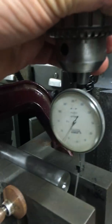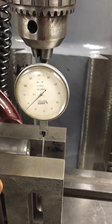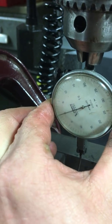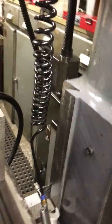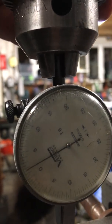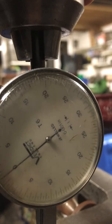So from naught to there I've got to move it about eleven thou. I come back to the side I can see easiest and wind the actual handle of the machine to position the table, going back roughly eleven thou to approximately that position. Zero the clock at that position, wind it just to check it's on zero - which it is - then go around to the opposite side. And there we have it, it's about a thou out.